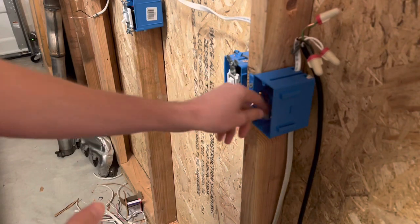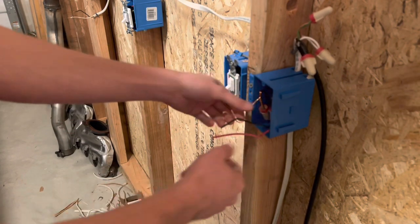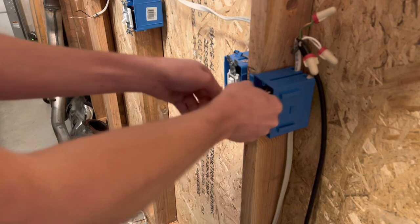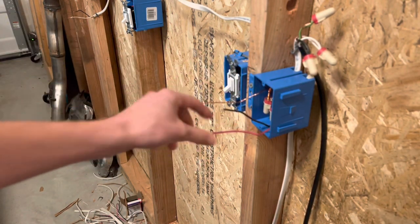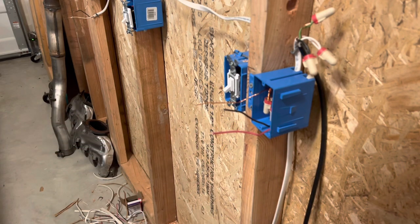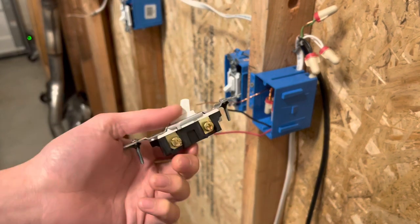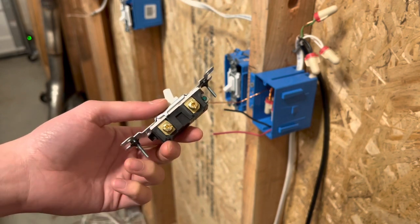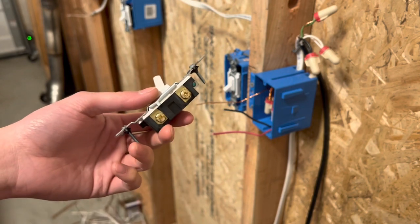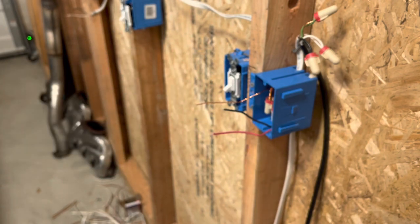As you remember from last time where I left this, just pull out your wires after you're done roughing in your box and you're ready to install. This is going to be like a normal switch — you have your power right here and this is technically your switch leg, but it's just going down to the plug. So it hooks up to a normal switch like normal: your ground and your two black wires. It doesn't matter which one goes to which; it's still just a normal on-off switch.